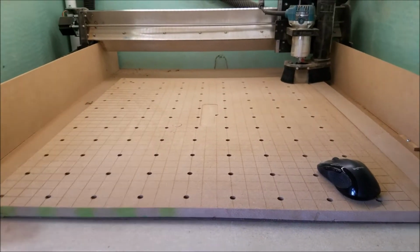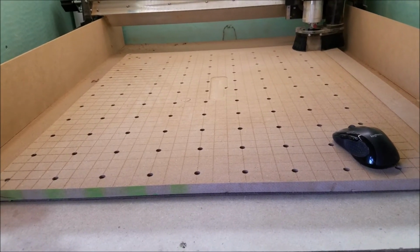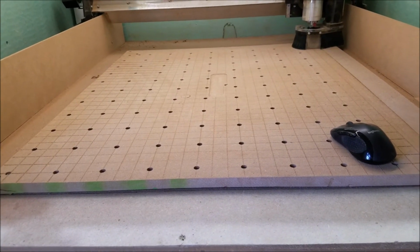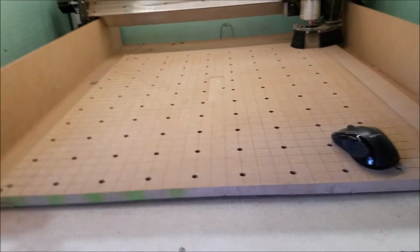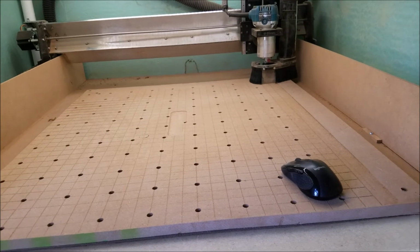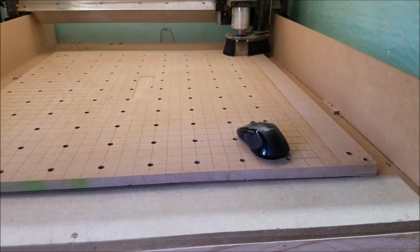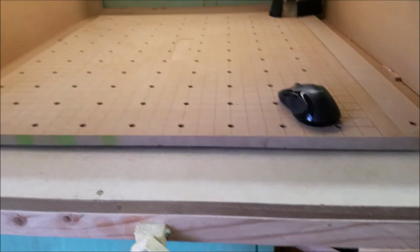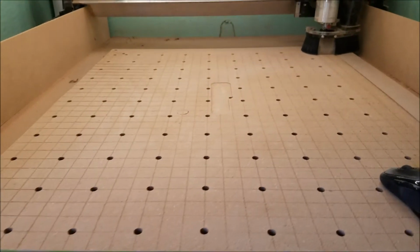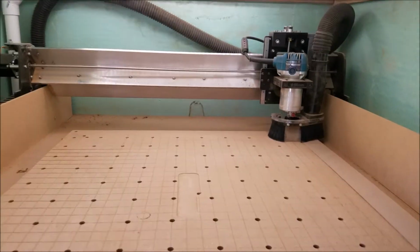He hopped on board with this, and I had to do the same thing because the Bobs just wasn't holding true. I was getting very poor cuts, very poor results because of excess tension in the Z-travel. The extra tension, plywood couldn't hold it still enough. It can't. When you start doing cutouts and stuff, you're going to get a little bit of torque on that Z-travel, and the Bobs will flex back and forth.